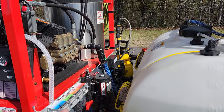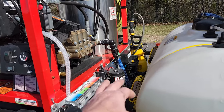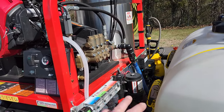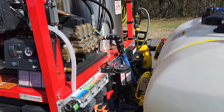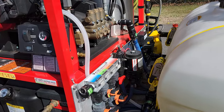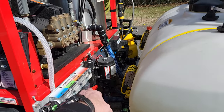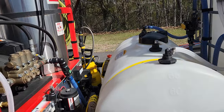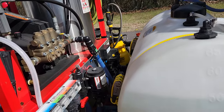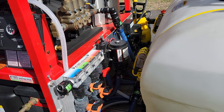Another advantage of having this system set up this way is troubleshooting. I can set pressure switches, do checks for leaks — everything I need to do without even hooking the system up to anything or spraying a drop of water. I simply turn on the transfer switch there and the transfer switch there, and then I can cycle whatever I need to and assess what's going on or set a pressure switch without actually ever spraying anything.